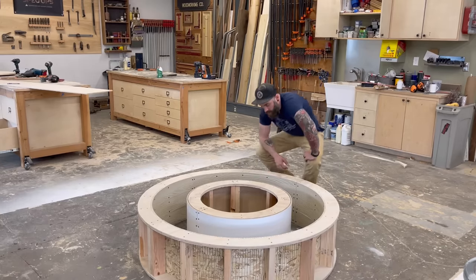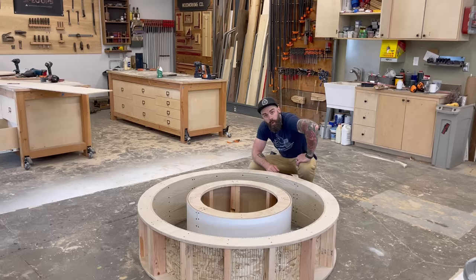Because I cut it into three separate sections, I had to add my quarter-inch melamine in three separate sections too — overlapping the seams would defeat the purpose of cutting it into three pieces. I hooked on the skin for my internal form with screws, leaving them purposely a little proud, hoping this would give the opposite effect once the concrete was poured and make them look countersunk in the actual pour. And with that, my form was complete and I was pretty much ready to pour some concrete.